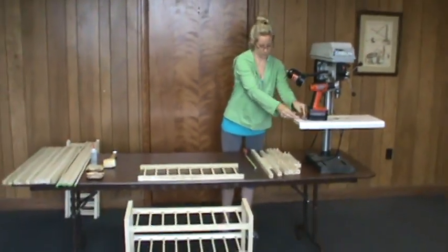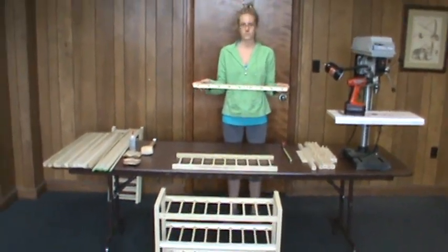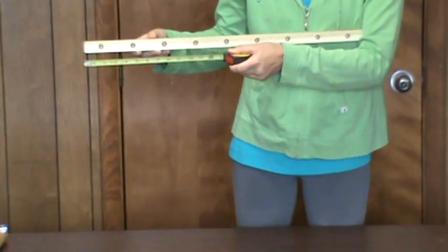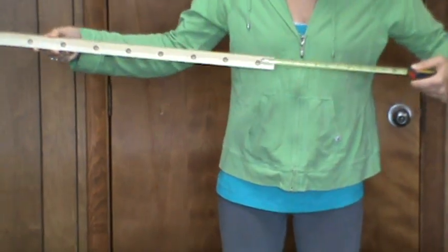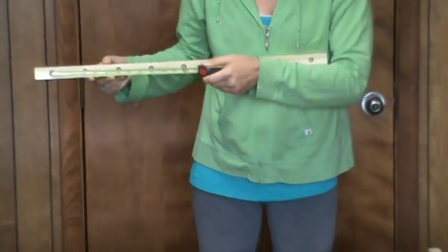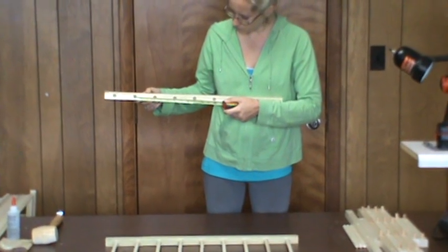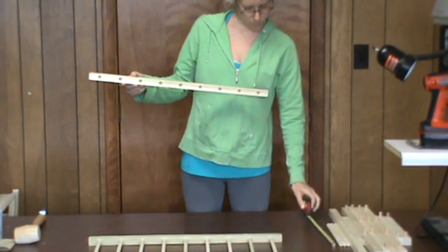Begin by cutting and drilling the parts for the shelves. Cut 8 pieces of 1 inch by 36 inch squares to 27 inches in length for the shelf frames. Mark 1.5 inches from each end and drill 1/2 inch holes 3/4 inches deep. From the center of one of those holes, drill 7 holes 3 inches on center. Each piece will have 9 1/2 inch holes on that side.